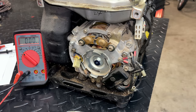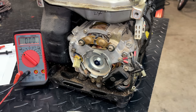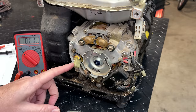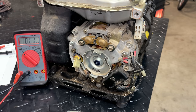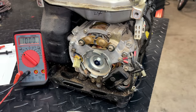I think the biggest issue to overcome is how much DC do we need to supply to the field, because at 120 volts, those universal AVRs can only provide about 32 volts DC. So I think what I want to do is start the generator up, supply DC power, and see how much we need to provide to get to 120 volts without a load. And it needs to be less than 32, because when under load, it has to increase the voltage up to 32 volts to the field to keep running at 120 volts.